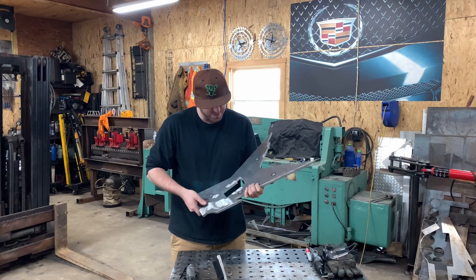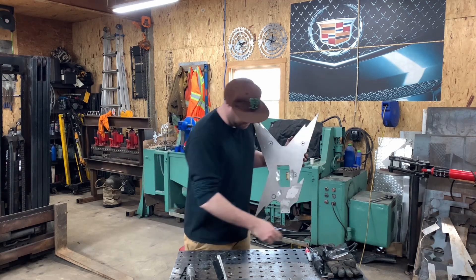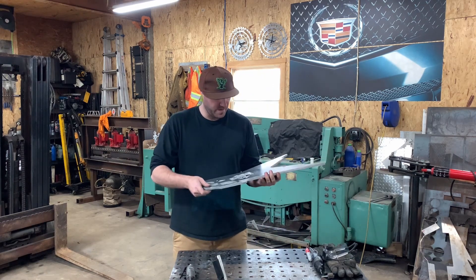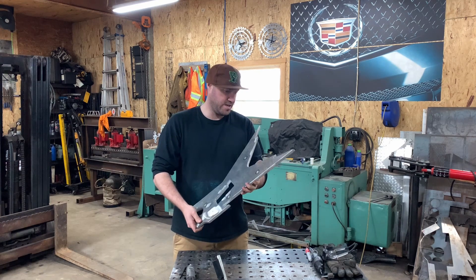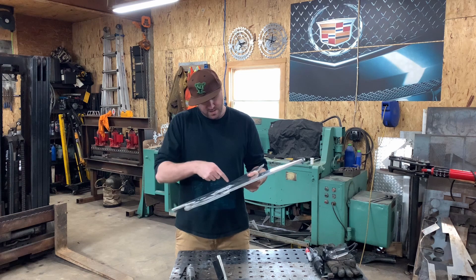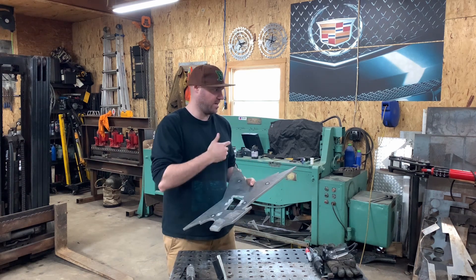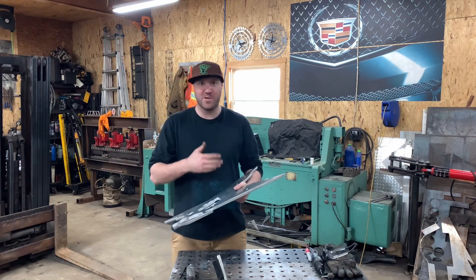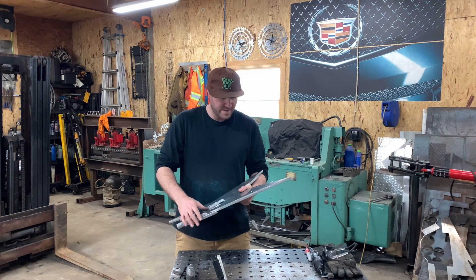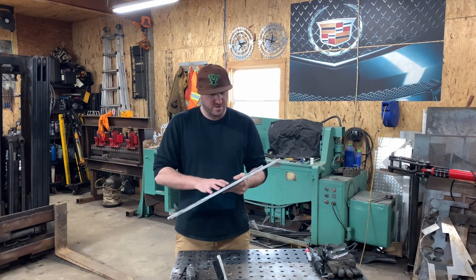I think I've managed to save these couple of holes. I also went ahead and drilled a couple of holes for the claw, for the springs, for our whammy bar — our Floyd Rose — whatever terminology you'd like to use. So I'm going to go ahead now, get this ready for powder coat, and clean everything up with the grinder. Once I get that done, I'm finally going to put the pickguard back on and clearance it for the Floyd Rose, do a test fit of all that. And if that's good, break it all down, ship it to powder coat, and we'll get this powder coated.